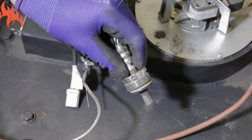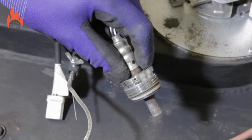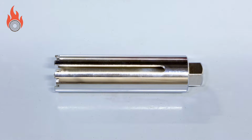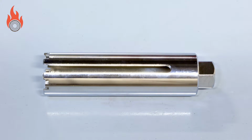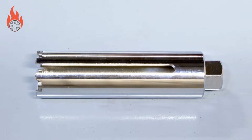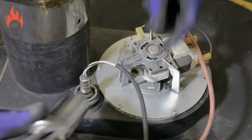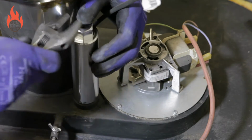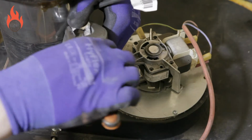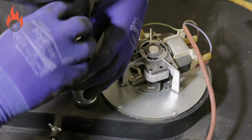When servicing a biomass boiler, you will need to clean the Lambda sensor as it will attract soot buildup over time. The simplest way to clean the sensor is to hoover it in situ. But if you do need to clean a Lambda sensor, then carefully remove it from the boiler using an appropriate tool. Many boiler manufacturers will have a tool specific to your boiler, or will use a box spanner. Using a standard set of spanners or pliers will often damage the washer arrangement used to hold the sensor in place.